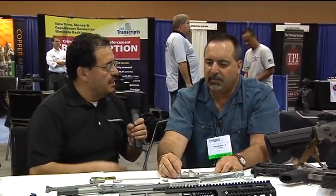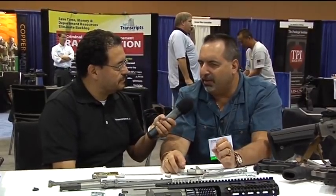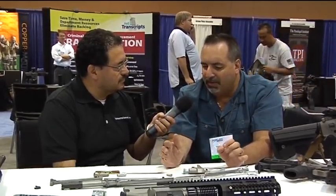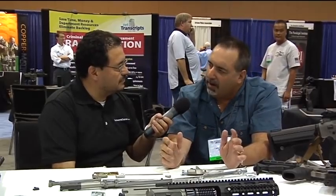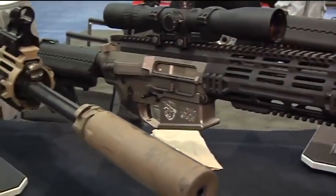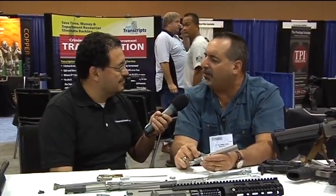What else? One of the neatest and latest features we've done is a standard cam pin — everyone knows the rectangle head if they know AR-15 or M-16 platforms. We've built a roller head on ours, so we reduce drag and friction on the upper receiver. The head on our cam pin rolls. If you have less friction and drag on the system, and you're piston-driven with pneumatic cylinders outside on the barrel, you don't have carbon buildup inside the action. This also lessens drag from dirt or debris — it rolls with a roller cam pin.